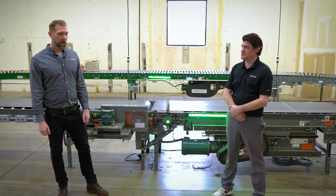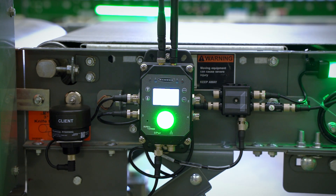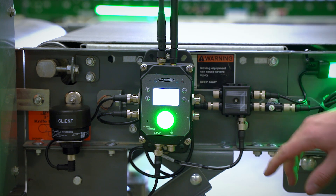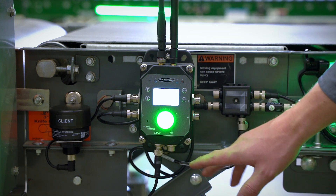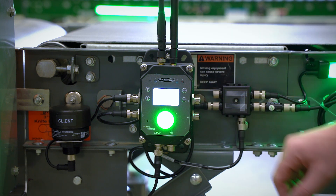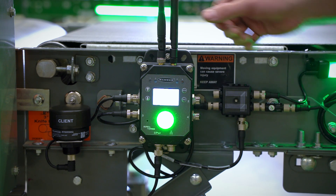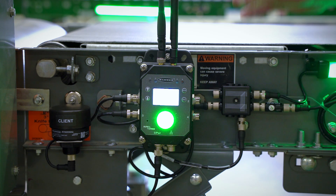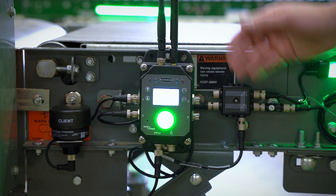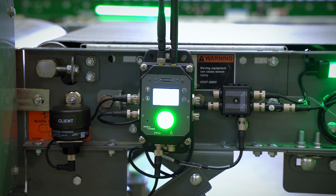So does that mean I can do multiple topologies? Absolutely — wired and wireless. Let's talk about the features first. This really is a DXM R90 and a DXM 1200 wireless controller all rolled up into one. You've got your five Modbus ports like the DXM R90 — ports one, two, three, four, and zero. You also have your Ethernet cable for connecting to Ethernet networks. If you need to jump that network, you can use a cellular radio with its antenna on the left. You can also have the ISM radio network, so you're talking to not only wired networks but also wireless networks, whether those are performance or multi-hop. You've got your LCD screen, which you can configure via XML to see data right on the display. And there's a new RGB indicator that you can configure for alarm states right here at the device.